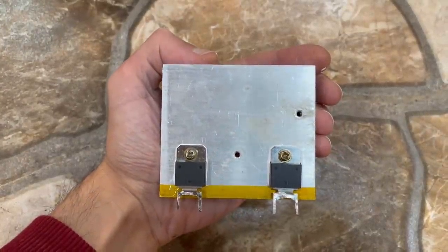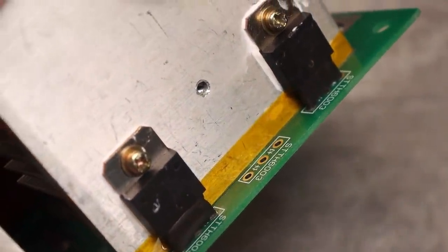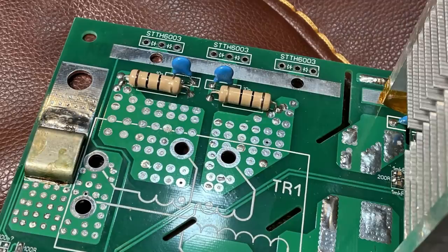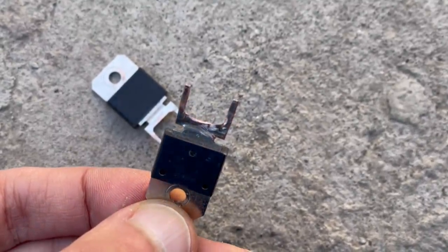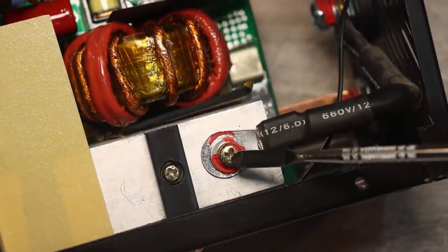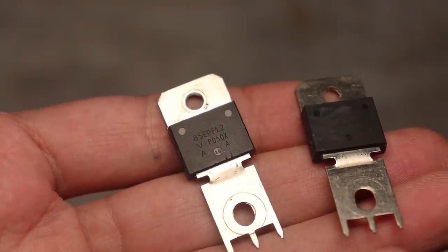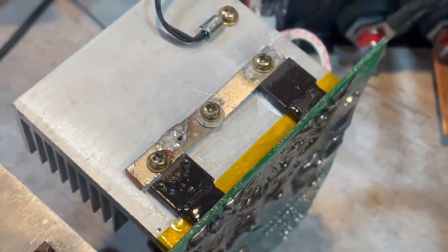For such a rectifier, at least 2 diodes are needed, one in each shoulder. The problem was that these diodes are in a different package and you can't just put them on the board. So I had to come up with something. But everything is reliable. The current is taken from the radiator. Here I tried to do everything to provide good conditions for this. The substrates of the diodes are the cathode. A copper bus was additionally screwed to them.